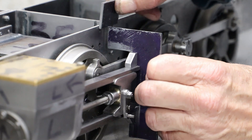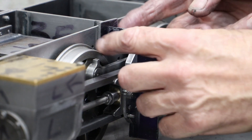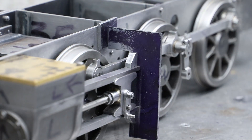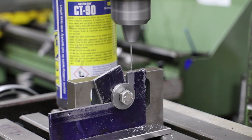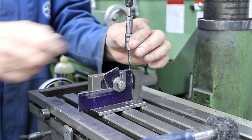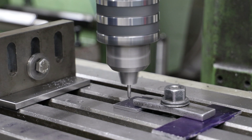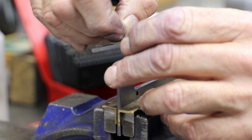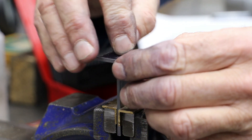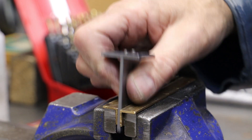For the part of the top bracket that sits against the frame, I've already cut a piece of mild steel, although it is deliberately oversized in the vertical dimension. To progress I need to find a way of fixing it to the main body, and I do that by drilling and tapping two 10BA holes in the edge of the main body of the motion plate — being very careful, as it's so easy to break these small drills and taps. After drilling the corresponding holes in the bracket, I fit it temporarily to the motion plate and then park it — we'll come back to this one later.